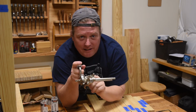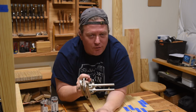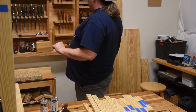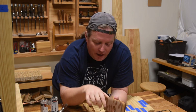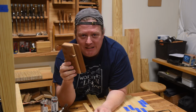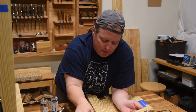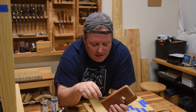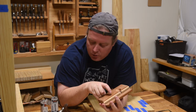Put a 1/4 inch blade in there because I'm using 1/4 inch for my panels, and set up the distance over, have at it. I use this grooving plane for all my drawer bottoms. It cuts a 1/4 inch groove, a 1/4 inch over, a 1/4 inch deep. This is perfectly set up for it. You could even do it both directions. Oh, I need to tighten up my blade. But this is something I normally have set up back there that has a one-purpose goal. And yeah, I will probably start making these again sometime in late 2020.